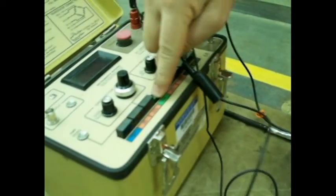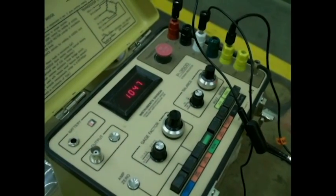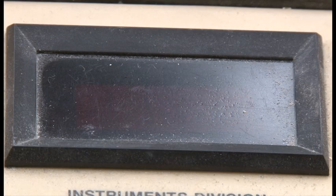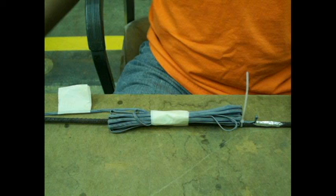Turn the strain indicator on by pressing the green RUN button. If the strain gauge is working properly, the strain indicator will show a relatively steady value with not much change. If the strain indicator reading is jumping around, flashing, or showing flashing zeros, the strain gauge is not working — in this case, check the strain gauge troubleshooting guide. If there are many strain gauges to keep track of, a good labeling scheme can save a lot of time. Tape such as masking tape, duct tape, or zip ties make good labels. You may also wish to secure the shielded wire — in the case of rebar, the shielded wire can just be taped to the rebar close to the strain gauge, or secured in some other way near the strain gauge.